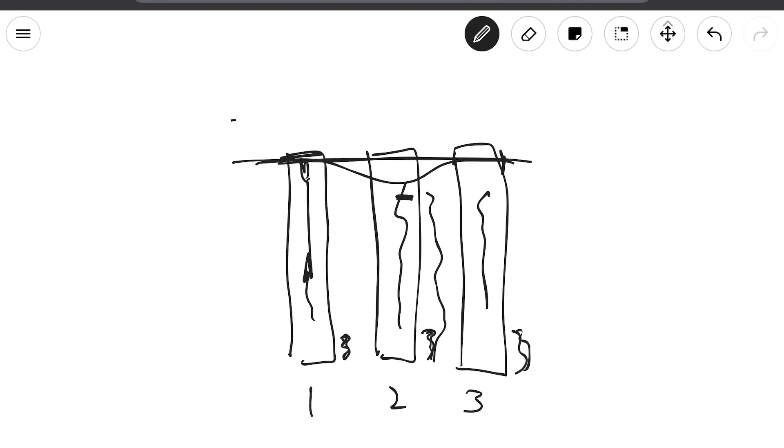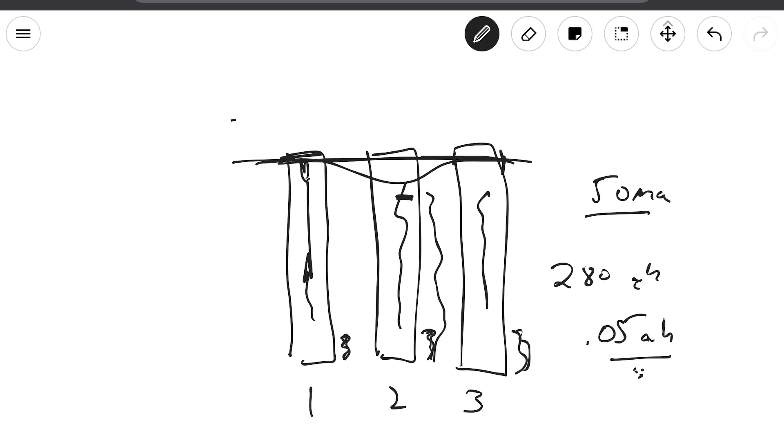Having a passive balancer could make you lazy. You don't want to become a passive user of your batteries. Even if you put a passive balancer on there, it's still a good idea to check the voltage of each of your cells every six months or every year. You don't want to put that on there and just think everything's totally fine and you don't need to pay attention to your battery, because plenty of things can go wrong — one of your cells could die, your BMS could be having issues. If you're going to build your own battery, you are going to want to check up on it once in a while, and you shouldn't think a passive balancer is going to solve all your problems.